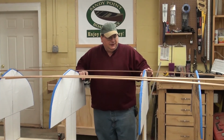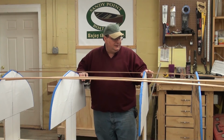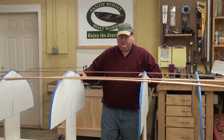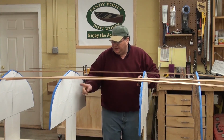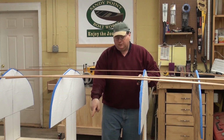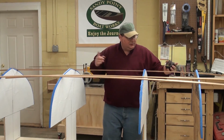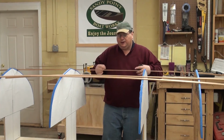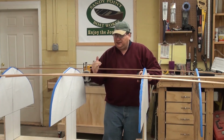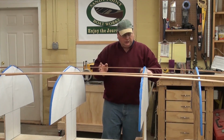These strips that you see stapled here are strips that didn't make the cut for customers. We have a whole batch of them over there for one reason or another. What we do is put a couple on either side to stiffen these up, and you can see, no more wobble to them. The best way to do that is to put a right angle right here, and make sure they're all standing exactly upright with respect to the strongback. Then you have to do it a couple of times: go down and do it on one side, and then take the square and do the same thing again, because as you pull one side in and the other side in, it's going to pull it up tight. So as you get these strips on both sides, now they're all standing up straight. More importantly, they're all the right spacing apart.